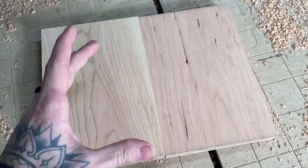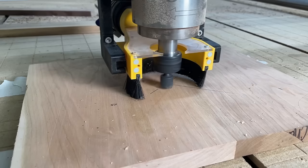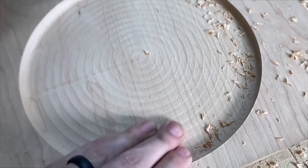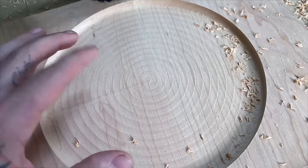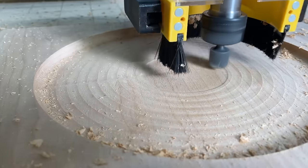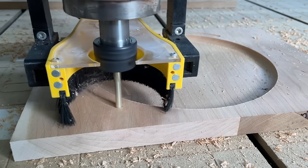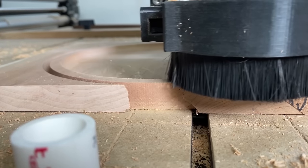Another thing to be aware of is grain direction. If you're gonna do a long tray, you want the grain direction to go with the longest direction of the board. Now we're getting started on this basic round tray using a three-quarter-inch bull bit. After the bull cut, you can see all these little rings — these are step-over lines. The average step-over is 40%, which is typically stock in your software. You can lower that to make the rings much closer, leaving almost a flawless finish. Before was 40% step-over and this is 10% — you can see how much cleaner the surface is. Then we finish with a quarter-inch down cut, and you can see setting your Z zero from the wasteboard leaves it super close every time.